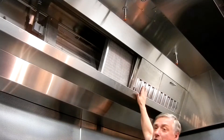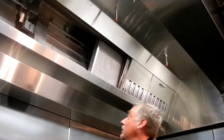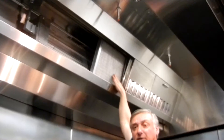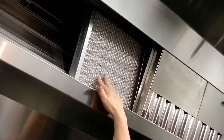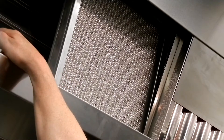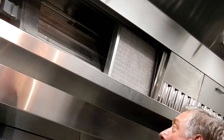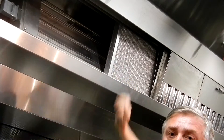If you use ultraviolet technology, basically what we do is as follows. We have cartridge filters — we want to remove 95% of 10 microns and larger. We have mesh filters as a secondary filter, and the mesh is used to stop any large particulate from hitting the light bulbs. Once we leave the back of the mesh with the exhaust air, now we're under 5 microns in size, and the lights love that.